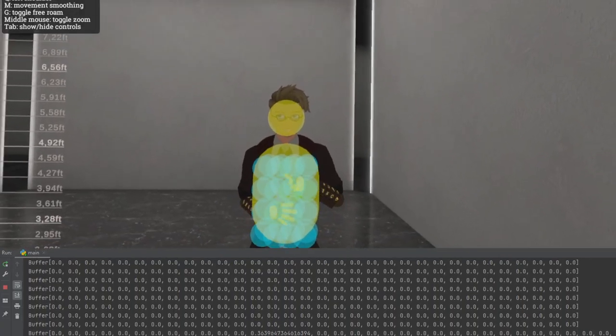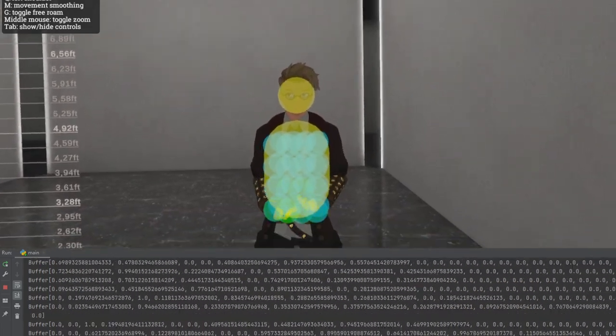So to stop the message overload, I figured out how to make a short asynchronous loop to buffer the messages and send them all at once in a 32 long message like I had originally intended. I wasted a whole day on this because I managed to speed read over the single part of documentation that mentioned exactly how to avoid this. I'm a genius of thorough practice and procedure. What can I say? Anyway, with this buffer functionality, I could tune the data rate to something reasonable while still keeping the vest responsive. And after doing all that, at long last, the final few things to check off the list were done. My DIY haptic vest was fully operational.